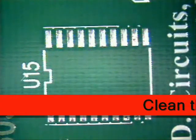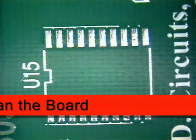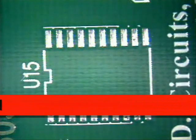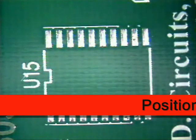The first step, which we have already done for you, was to clean our board of any contaminants. Because sometimes you accidentally touch the board pattern areas — the lands — and you get oils from your hands and acids, which could contaminate and create poor solder joints.